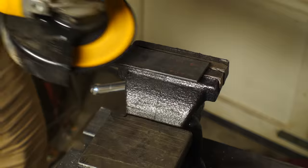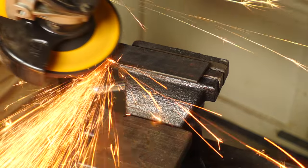You can also use a grinding wheel, which is a thicker abrasive disc, and this is great for sharpening things, whether it's a knife or blades for your lawnmower. These come in many different grits, so look at all of your options and figure out what you want to sharpen and how you want to sharpen it before you pick out your wheel. A grinding wheel is also exactly what you need if you've done a welding project and you need to clean that down to a fully flat surface.